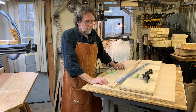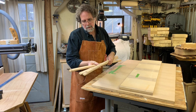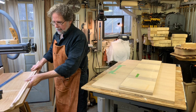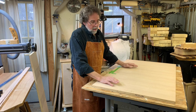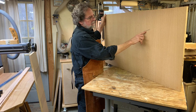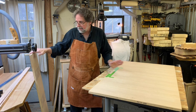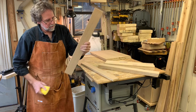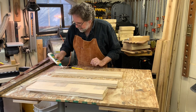I've got some material out - t-track, some clamps, nothing else fancy. I made up some runners out of oak, I just need to do a little sanding on these. I always have a few of them in the shop. I've got some scrap plywood to make parts out of. Somebody will inevitably comment that this is oak veneer plywood and that you can't use that for a cabinet - it's got some defect in the back. I've got things marked out; I'm actually going to get two sleds out of this, plus rails for the fence. Then I'll use this other piece for more rails. Just doing a little sanding to knock the stray fibers off the ends, then we'll glue up the pieces that will make the fence.